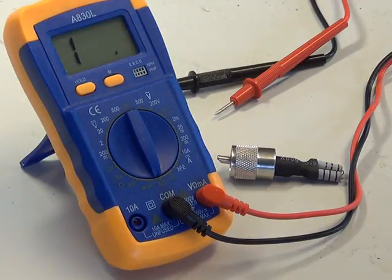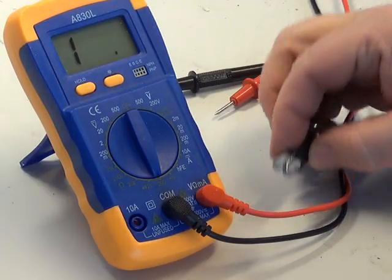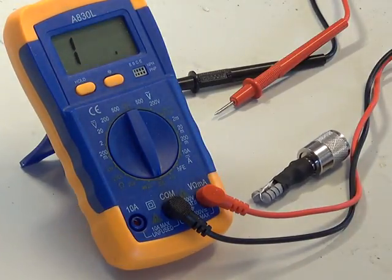And that brings us to another point — that meter was only something like £2.99 delivered from China using AliExpress, so things don't have to be really expensive. There you have it: a very cheap to make dummy load comprising a PL259 plug and two 100 ohm 5 watt resistors. I bought those resistors off eBay and they'll be good for normal CB radio use. I'll show you it in use in a subsequent video. Thank you for watching.